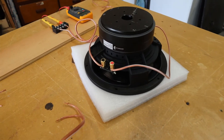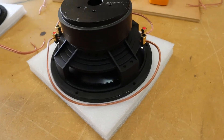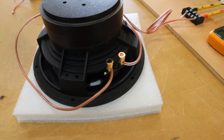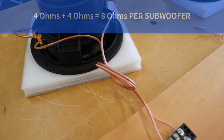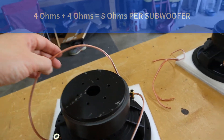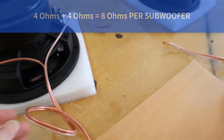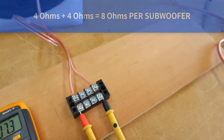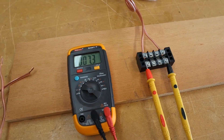To do that, you wire the positive speaker wire to the positive lead of one of the voice coils, and then wire the negative speaker wire to the negative terminal of the other voice coil. Now you've wired up both voice coils but they're not connected together. In order to connect them together, you run a jumper wire from the negative of the first voice coil over to the positive of the second voice coil. Then you run your single pair of wires to your terminal cup, and now that terminal cup is hooked up to an eight ohm load.